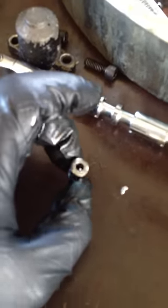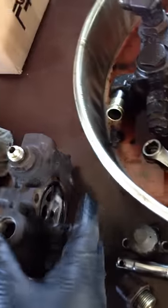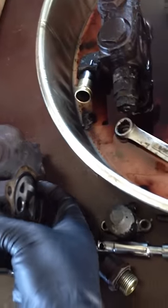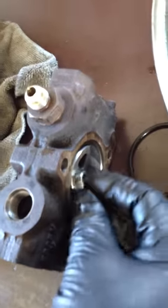Dump that piece out of there. I'm going to put this back together and hopefully it'll work normal. It's pretty simple how this thing is held together — just three through bolts that go right through the middle of it. There are these pretty good size O-rings, and these little guys with springs go in head first. Spring goes in behind it, sandwich them all together — should be good to go.